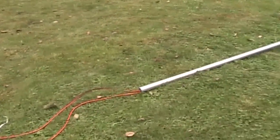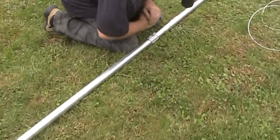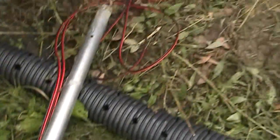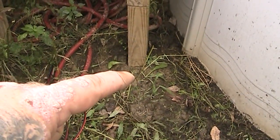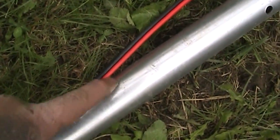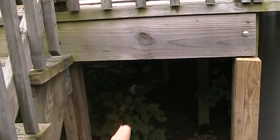You can see we've got it all run out here, run it through the conduit. Bill's putting the coupling on right here. So you start the connection of the conduit wires down here at the end, a couple of feet up. We've drilled some holes into the conduit and we're going to lag-bolt them. Those 4x4 posts for the deck are set in concrete underneath. So we're going to run the end of the conduit pipe right here on top of the concrete and then lag-bolt them to the deck poles and use that as our main support as we go up. We also cut a hole out of the side of the pipe for the wires to come through.